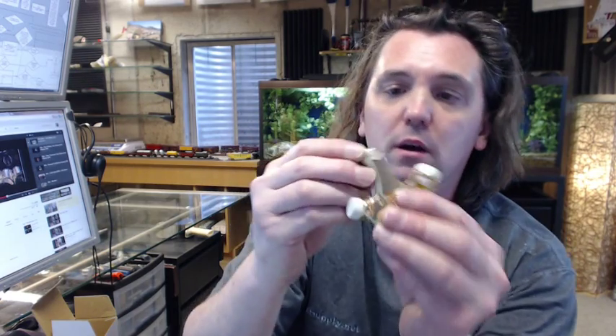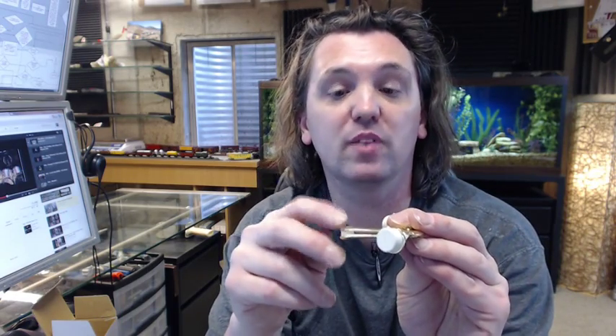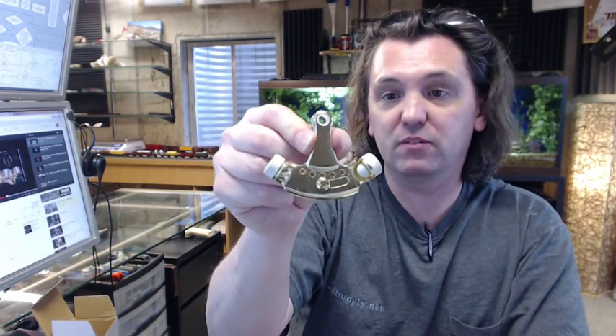It has a plastic bushing here that you would use with a 3.5 inch hinge. I've even had people knock that out and stick a hinge pin from a 4.5 inch hinge down through it, and while it's not necessarily intended for that, people have done it with success.